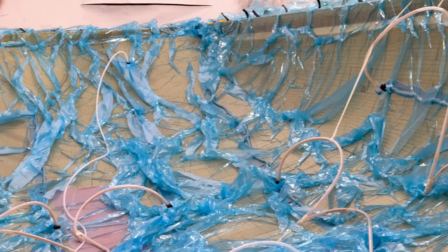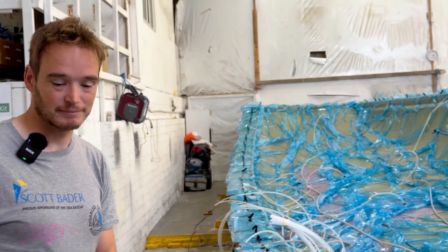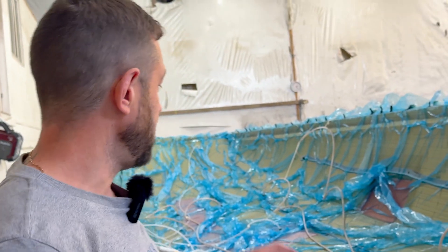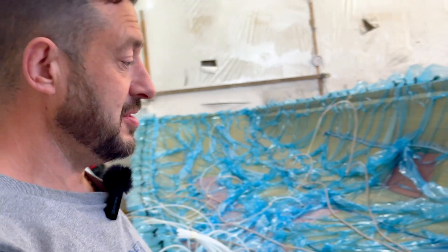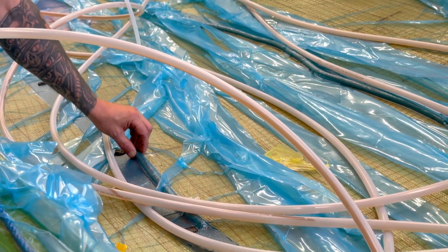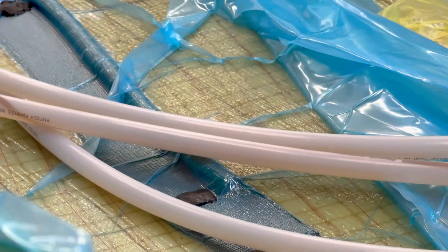So that's where we go from there, and then we move on to the infusion process that Dan's going to talk about. The challenging part is how we get all the resin to all the areas we need, especially in our high laminate areas. On the job you can see various different components. This is called a shrouded resin spiral — we pump the resin into the spiral, which then distributes it down the job. These spirals run the full length of the job in sections.